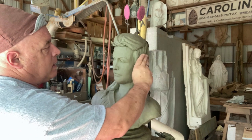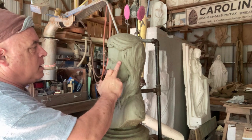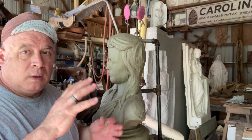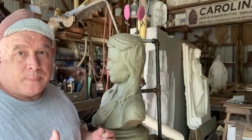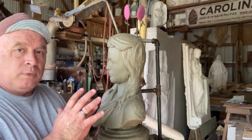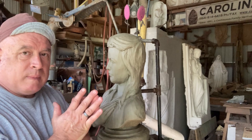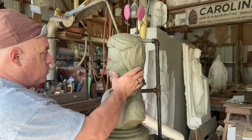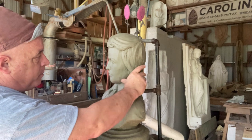I've got a mold that I like, I'm going to study, not one that I did, one that was done for a bronze that I did, and they use different rubber, but the hydrocal and the chop that's in it to support it is all married right to the rubber, and they don't separate, so you get a little better final result, because anytime you pull the mother off of the silicone, it doesn't always lay back in there just as perfect. And this one I want to try to do it as well as I can. So I'm going to try to do a little bit better mold.